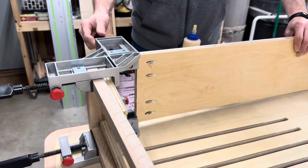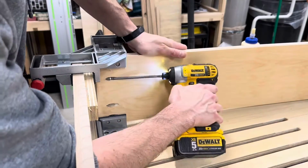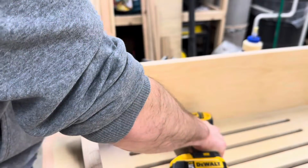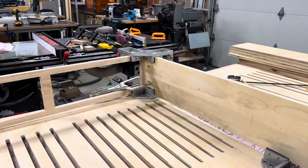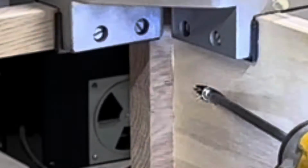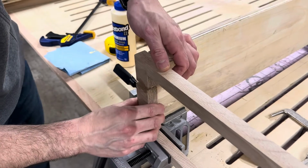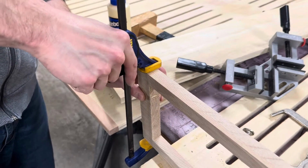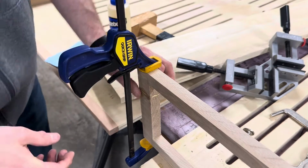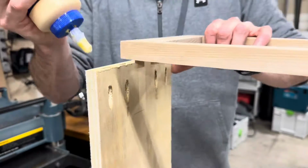One of my design requirements was that the bed not creak in any sort of way, and you can probably imagine why. Anyway, I got a little optimistic with some of my pocket hole screw placements and ran into a small problem as you're about to see. I should have known better than to use pocket hole screws right there. Oak is prone to splitting when it's in thin slices like this, and with that grain orientation, it was inevitable. I glued the split back together and redid the joint with dominoes.